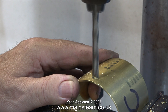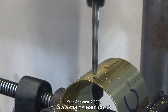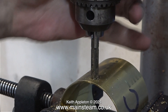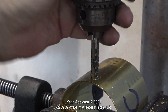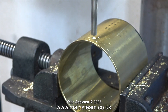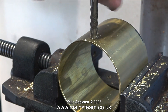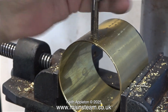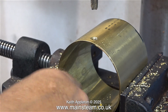You must not do the job like this — here, as a demonstration only, I'm going straight in with the twist drill. Always use the centre drill first because the twist drill can wander about. Luckily this one didn't; I kept it well under control. Here I'm threading the hole with the part still in the machine vise — this is a very accurate way to do it. Once the hole was threaded I turned the part round in the machine vise, but this time I used the normal centre drill to make sure the hole was in precisely the right place, and once again I threaded the part with it still in the machine vise. It's definitely a more accurate method and ensures that the tap always goes in square and doesn't wander about.